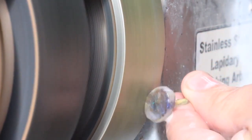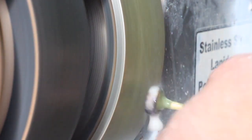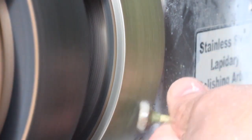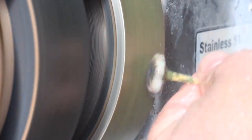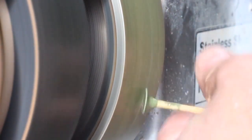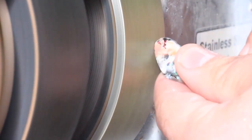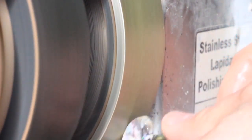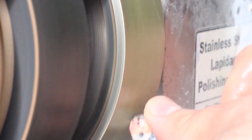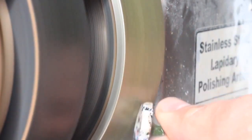The stone that I'm cutting here is all treated Andamooka matrix, so you can see as I start to cut it, the darker color starts to come off of the stone. That's why it needs to be retreated. And sometimes even my stones fall off, especially on this rough 100 grit wheel. The friction with this wheel vibrates the stone pretty hard, so sometimes they'll jump off when you're doing the initial shaping and you just have to re-dop them.